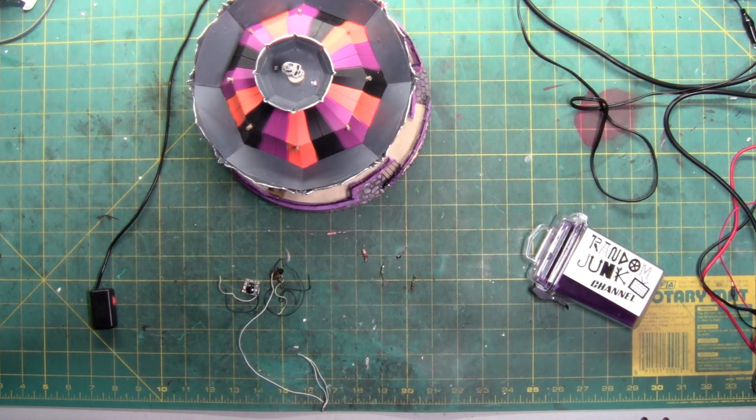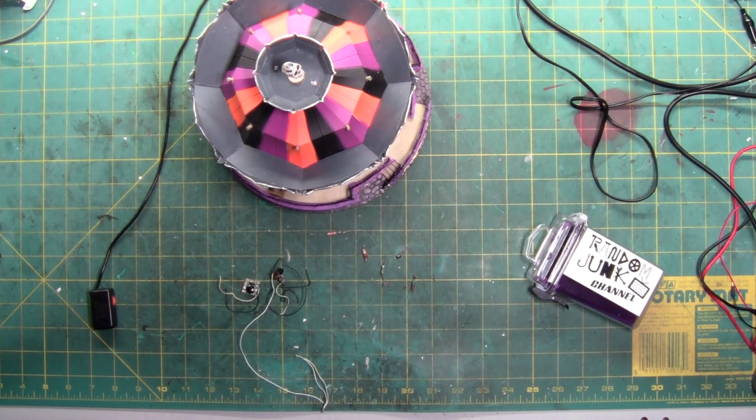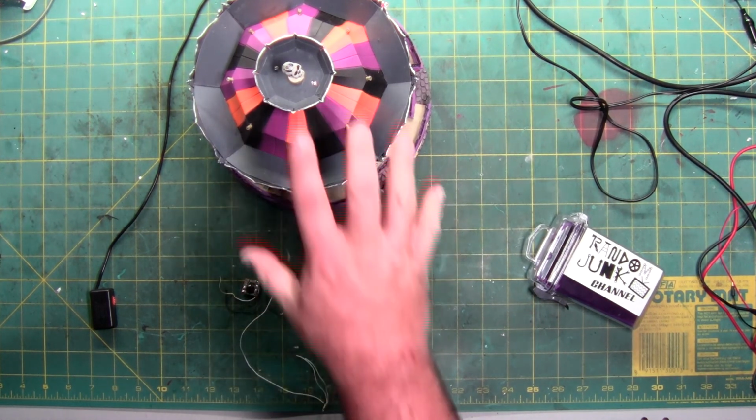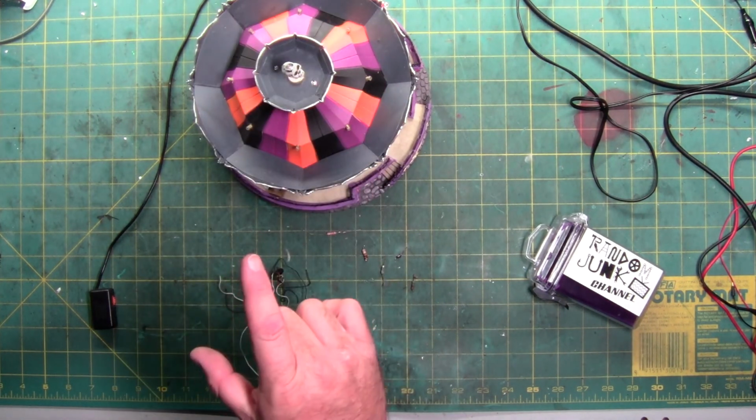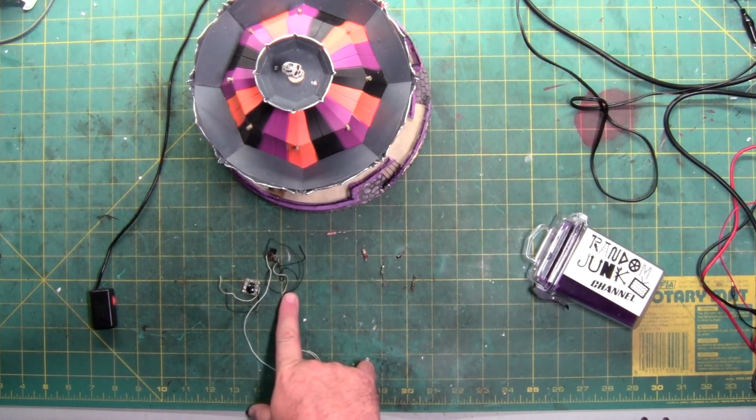This motor is designed to run up to 6 volts. It's running at 4.5 volts, so it's totally fine. At 6 volts, it spins a little bit quicker, but I wouldn't run a motor that fast in something like this for very long because it will get hot and wear out faster. But the little hobby motor that's in here is rated 3 to 6 volts. It's running about 4.5, so right in the middle. I think the original probably ran it closer to 3.5, honestly. Based on the video I can find of this unit, this does spin slightly faster because there's no motor control circuit.